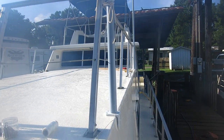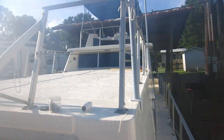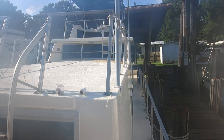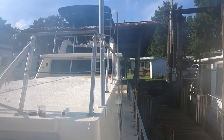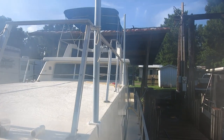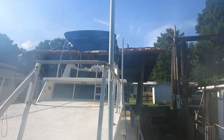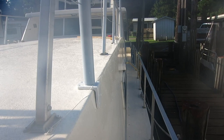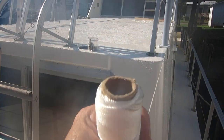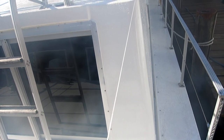According to my four-foot level the boat is floating level side to side. I put the level on the handrail in the front and the back. I have two posts sitting there — the first one is on a base that has screws in it, the one in the back is just sitting. I have them pulled level with little pieces of rope, and a string running down the side of them. That's how I'm going to align the tall post that sits in the back — I'll hold the string and the level at the same time.